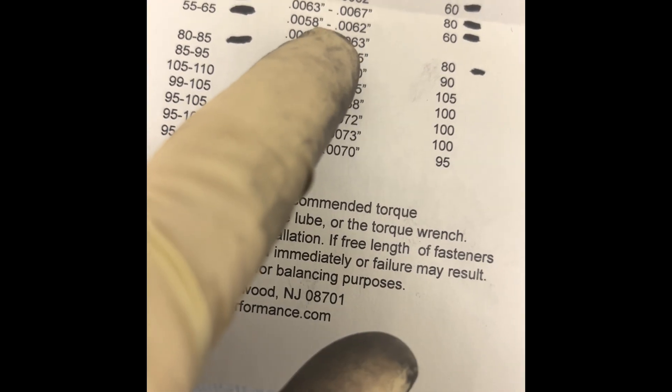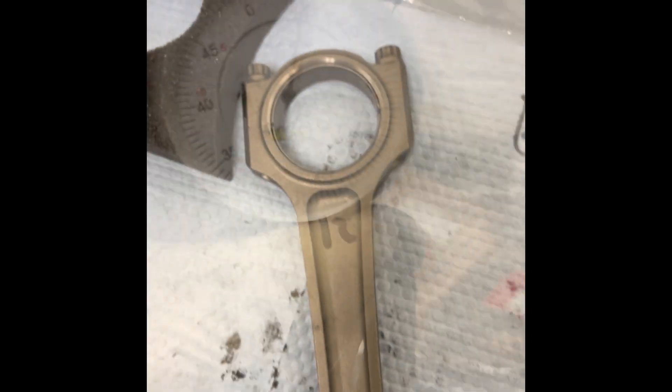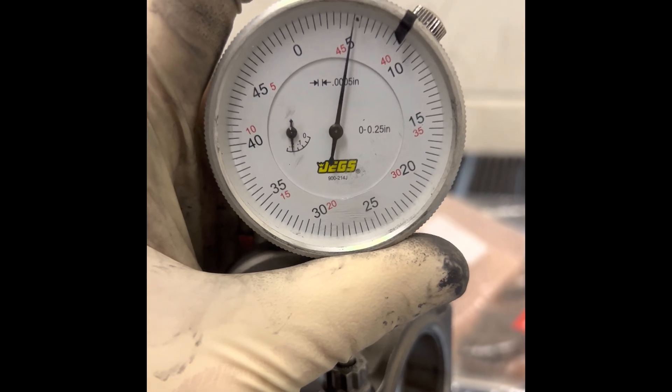Right about six — this one's about 58 to 62, and I'm at about 59-60, so I'm literally in that range — perfect. The other one: I flip this over, and instead of starting at zero I start at the negative-one value, because that bolt starts at negative one. Negative one plus five thousandths gets me to six thousandths — so this one's perfect too.